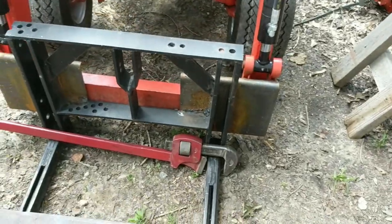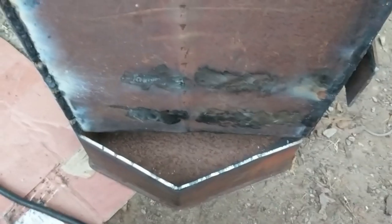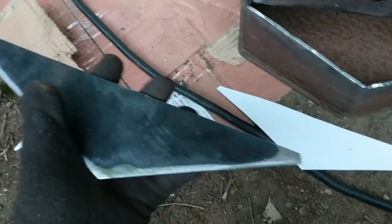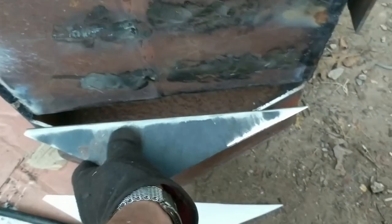So what I'll do first is the upper and lower seams, then back it up to the tractor, get the quick-attach adapter, weld it onto it, and then go through and reinforce it and clean it all up. Now I'm working on filling in the triangles that were created when we inset this facet. I began by making a cardstock template, then used the template to transfer onto some 3/16 plate and very accurately cut it on the bandsaw. Then I've gone through and beveled and sanded away any excess paint in the areas where it will actually have to be welded, so this piece will inset right there and be welded on that boundary.